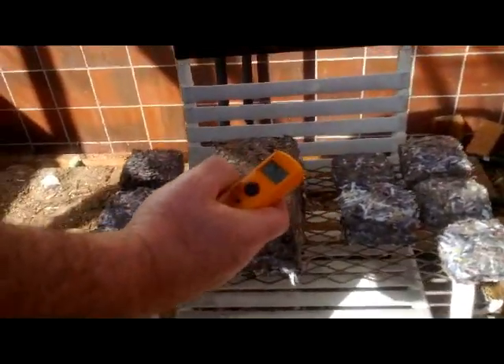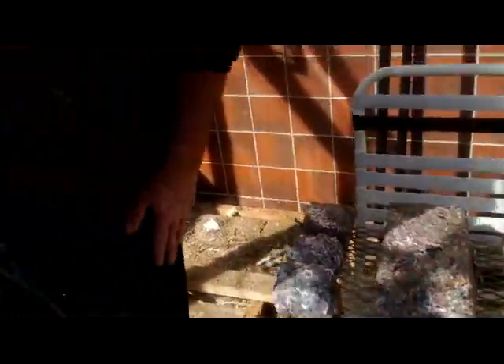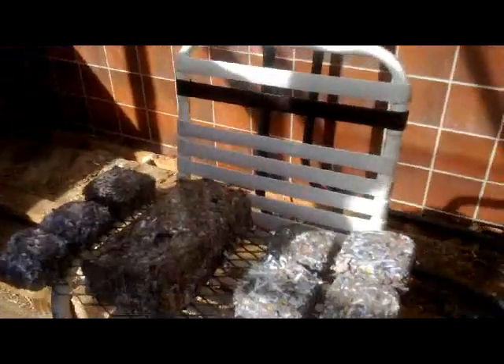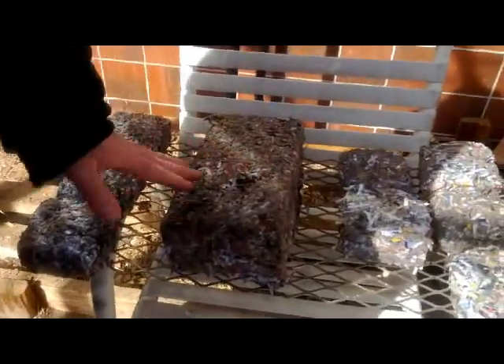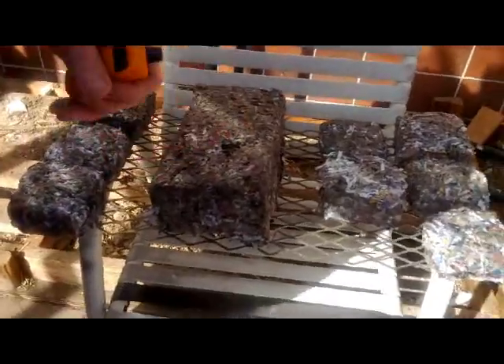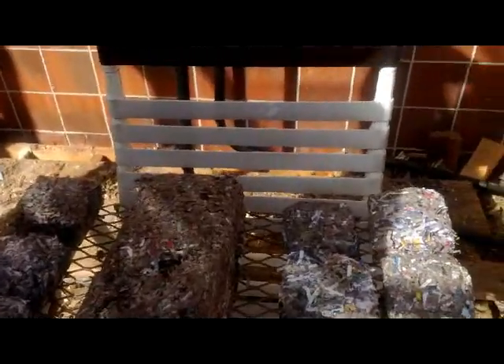In the greenhouse — you can see the greenhouse is better — it's 87 degrees in here. So with 87 degrees in the greenhouse, even though there's snow outside, it was 53 outside and 87 in here. I don't have the wood stoves burning today because the greenhouse is a lean-to so it's heating up. This is the southern exposure on the house, so the southern exposure heats up the inside pretty nicely and the wood stoves don't have to run today.